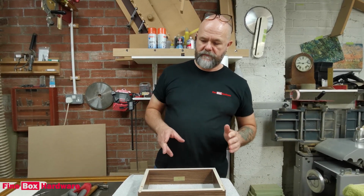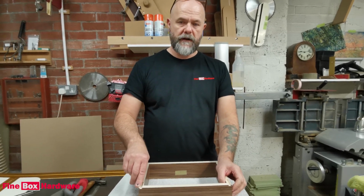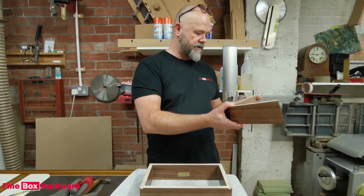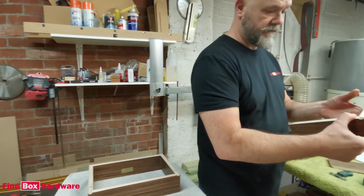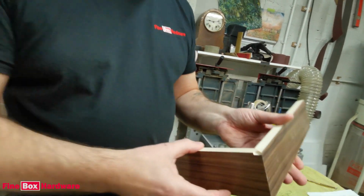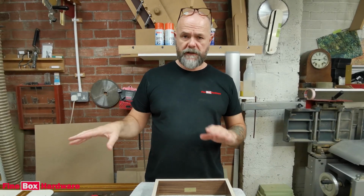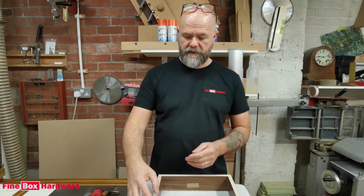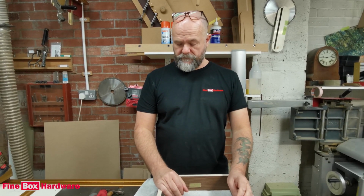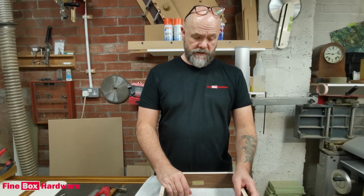I suppose if, for instance, anybody does have a wee bit of breakout, or they get one of the wee corners of the miters popping off, the way to fix it, it's a bit of a pain to be quite honest, but I just got this piece righted up. You really have to start off with a right angled section, and you need to right in slightly and then take that wee piece off and pop it in. I mean, if it happens, it happens. It's happened to me many's a time. The plunging definitely reduces that greatly. There's people that have used MDF clamped to it, stuff like that. Yeah, that works as well as a bit of a breakout part. But you've got to glue it on and then a bit of wax, touch up. Not the greatest approaches, but it really helps.